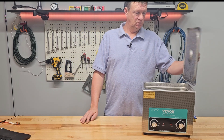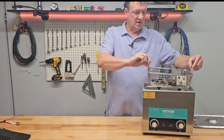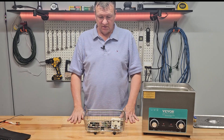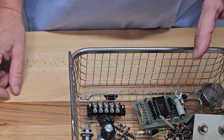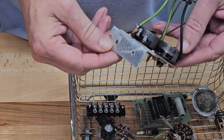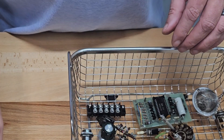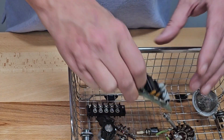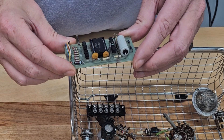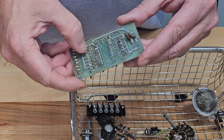And now it's done. Let's take a look at the parts — be careful because it is still hot, but luckily we have the basket so we don't have to reach down into that hot solution. Give it a little shake. First of all, the aluminum has come out pretty nice and clean. Now of course it goes without saying — you'll want to let these completely dry before applying power. The PC board is something you wouldn't normally think of washing, but as long as electricity is not applied to it or stored in it, it'll be just fine.